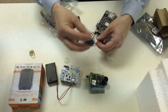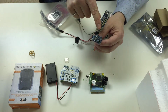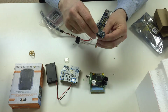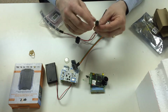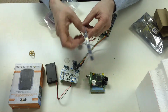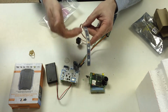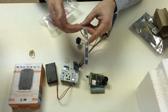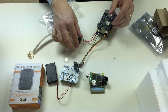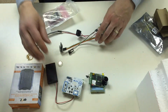This is our sensor, which will sense ultraviolet, infrared, and visible light. The one underneath it is an accelerometer, which measures how the box is moving. This is a noisemaker, so that it makes it easier to find the payload when you're done. This is a set of lights, which make it easy to find the payload when you're done, but it also gives you information about the current status of the payload to make sure that everything is working properly. You've got a big beefy power switch, and all of that stuff should be outside your box so that it's easily accessible.